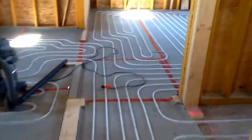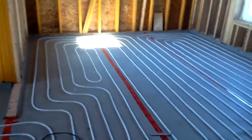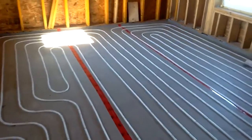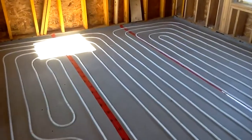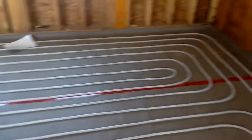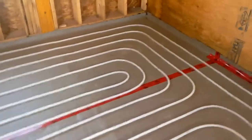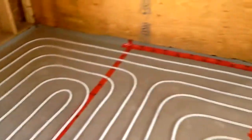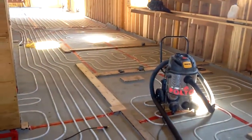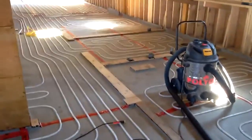That's it — just a quick video to give you a better idea of what we're doing on the upper side of the floors here at the Q Lofts. We're actually doing this on the mezzanine levels of the lofts as well, so it's not just between units. In the mezzanine levels, it's being done within the unit itself to decrease sound transfer from one unit through to the unit next door. That's it with respect to the rubber soundproofing membrane we're doing here at the Q Lofts.